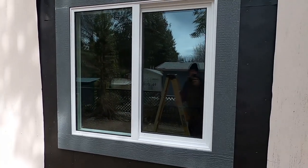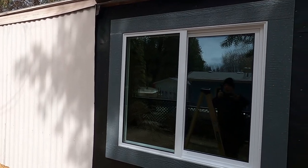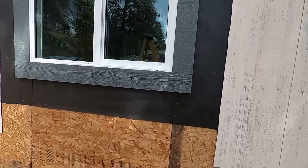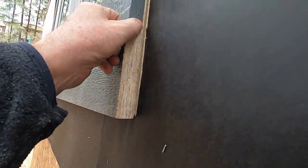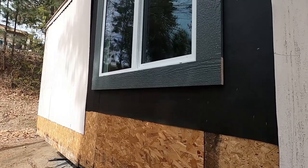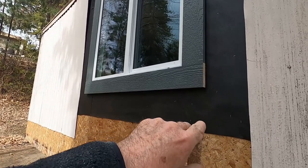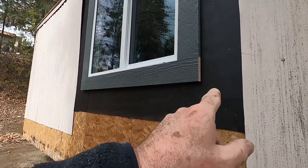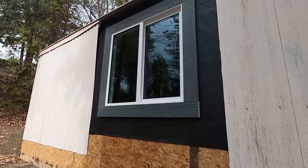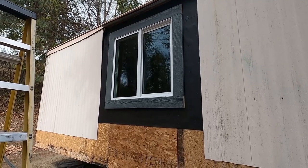There we have it — the window is all trimmed out. With the back caulking in there, that's all sealed right out to the edge of the trim and watertight. All we have left to do is paint the sawn ends, then give the whole thing a second coat of finished gray paint. We'll do all that painting before we put our vinyl siding on, so we're not painting up against the vinyl siding — everything is finished painted and then we put the siding up to it for a nice clean installation. I hope that was helpful; if you got anything out of that, give us a thumbs up, share the video, and we'll see you in the next one.